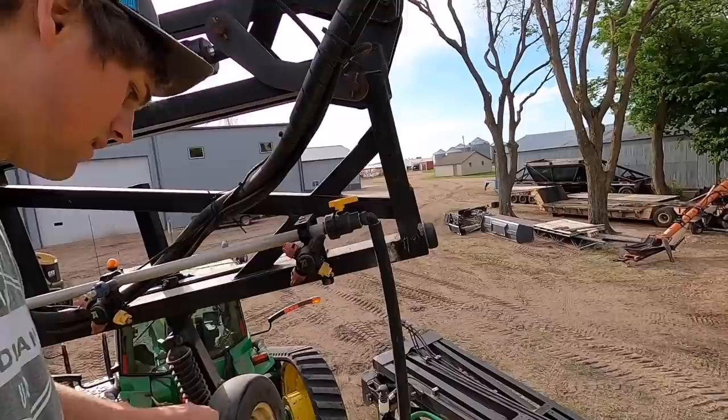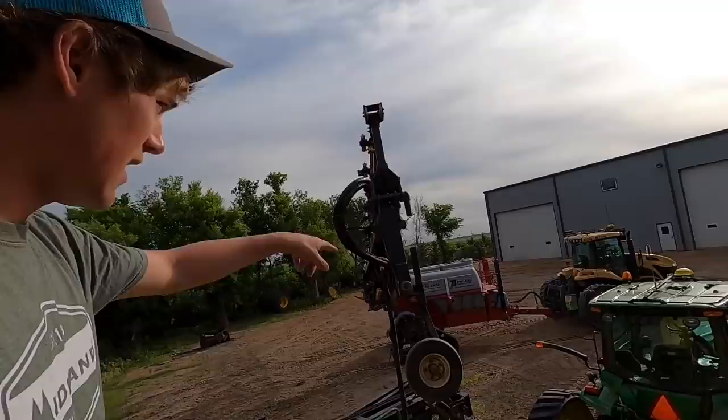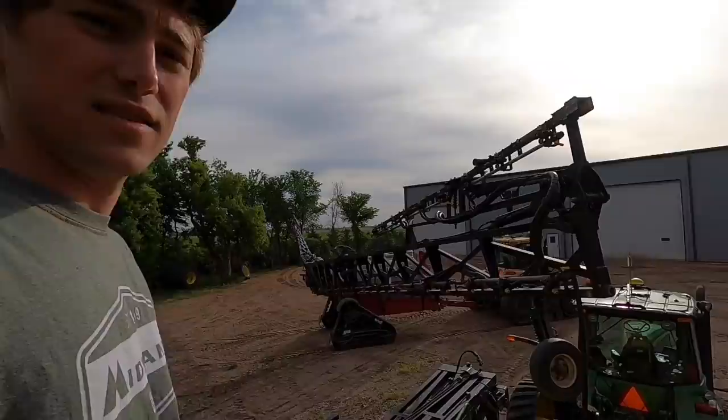Now we open this up. He'll get his pump going and then turn that section on. Hopefully he hits the right section control — there's ten of them on there. In theory it'll all empty out of that sprayer through this one section. If you turn these here in the midway, no chemical comes out, so in theory it should only come out of that one. I'm standing back because if he hits the wrong section, the nozzles are open and it's going to mist everywhere.